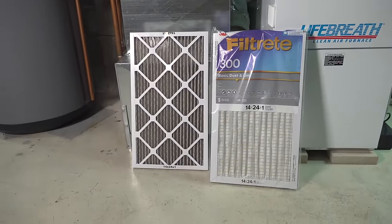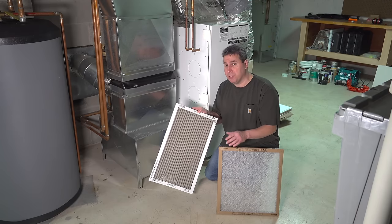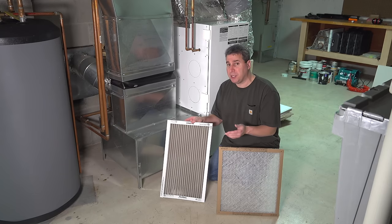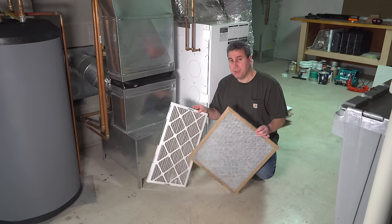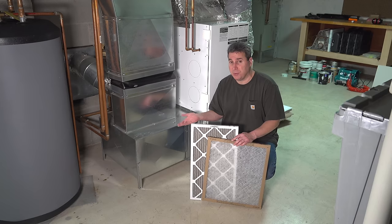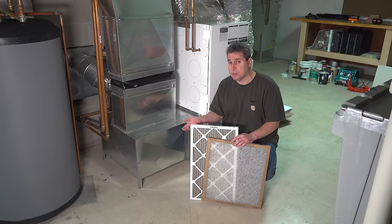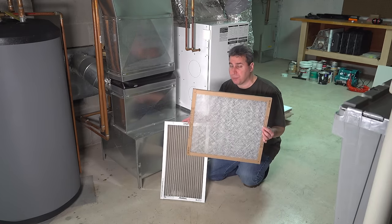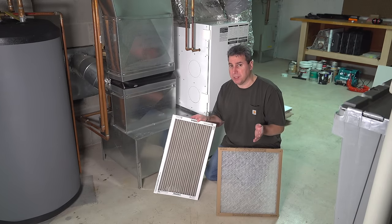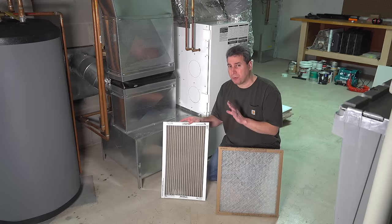The space between the holes in this filter is kind of a medium size. It catches dirt, some pollen, and pet hair — that's okay, but it's not super restrictive. When you look online, you'll see filters that can cost $30, $40, or even $50. They are so restrictive that you can actually have problems with your furnace because you can't get enough airflow through. The other misconception is that your furnace is not an air cleaner for your house — it doesn't run 24 hours a day, it just runs when the heat is on. My recommendation is to avoid the fiberglass filters and move up to one of the pleated middle-of-the-road versions. I'll link a few common ones in the description — they don't cost much more, they give you more filtration, but they don't get into those crazy restrictive filters.